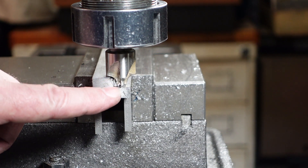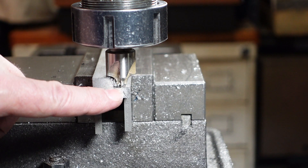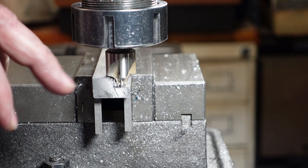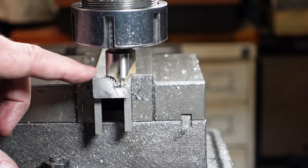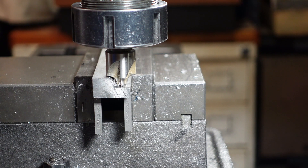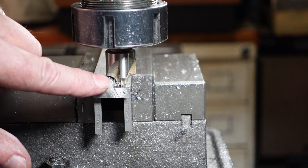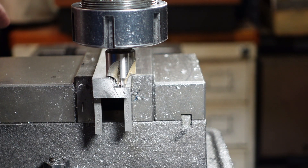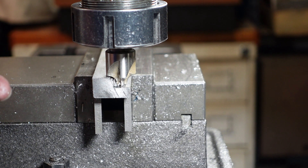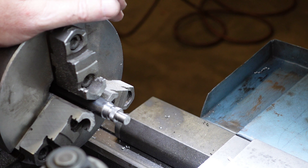I'm using a cutter to put a rounded edge on here. One thing with using this type of cutter: it's a good idea to do two passes — one pass with the corners about half a millimetre or so off the material, to take the corner off, then come back with a finish pass. This tip was actually taught to me by a woodworker in relation to woodworking routers, because if you try too deep a depth of cut you can burn the timber. So to preserve your cutter and your material, that was his answer — and it works.